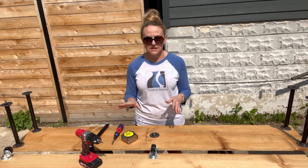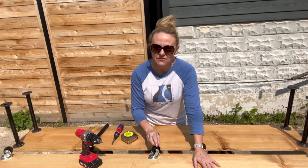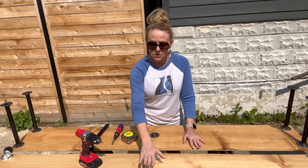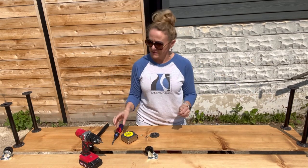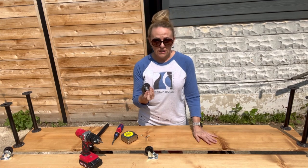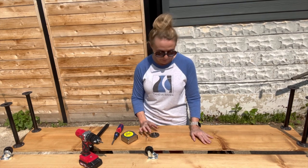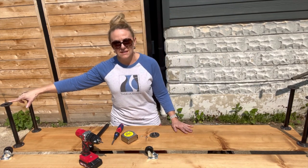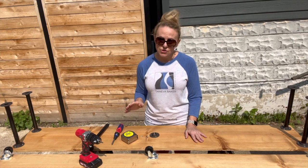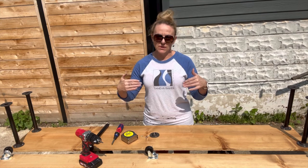So that's the prep — that's where we're at now. I have staged a few things to make this next step easier to explain. This is going to be the bottom shelf, and you can see I've already attached locking casters to the bottom so it's not going to easily roll around. I have two in the middle and two on each end for a total of six. I also have these floor flanges — I'll put a link below — and I've already pre-measured the center of my board. I have two posts at each end and one in the middle to support the middle so the shelves don't sag.